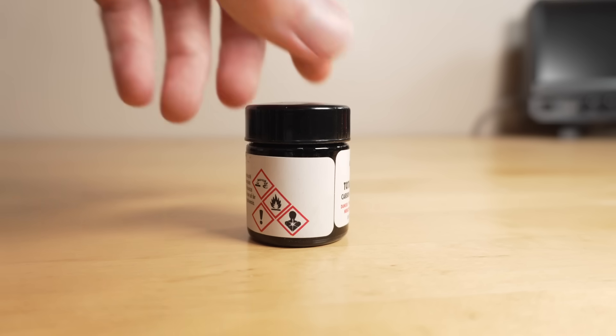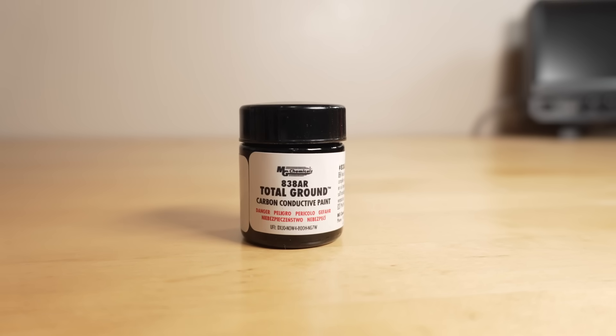This process is great for mass production, but it is terrible for a workshop environment. Electroless deposition requires over a dozen chemical steps and involves solutions that are corrosive, toxic, and difficult to maintain. For this project, we need to reinvent this standard process — and for usability, we want to remove all chemical baths. I have about a dozen different ideas for alternative via generation methods, but the one I chose to start with could hypothetically produce vias that are identical to production vias.